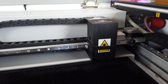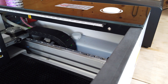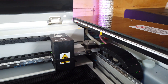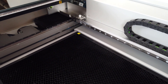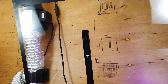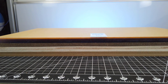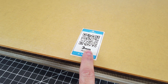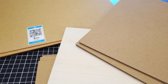The laser head and the y-axis are all running on linear rails, so movement should be very smooth on everything. And because this is a CO2 laser, it is liquid cooled. You can see the blue liquid inside of the laser tube at the back of the machine, and it goes all the way across to a radiator on the other side. There is a camera on the inside part of the glass lid, so you'll be able to see your entire work area. This machine did come with a bunch of materials that have a little QR code on them that it scans and knows exactly how to cut. You're not limited to just materials from them — you can use whatever you want, you just have to manually set everything up.